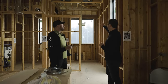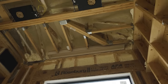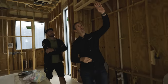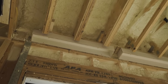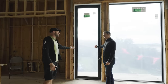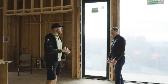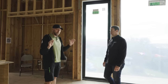Look how complicated this corner is behind us, Travis — we've got trusses, an angle, a bunch of angle brackets, and really amazing pre-planning there. On the other hand, we made a mistake. You noticed this right away — what's going on with that plywood on those trusses? As someone who has had to modify a truss in the past, that's the telltale plywood wrap. This is a door, not a window. So if you go around and make all your pockets off the window schedule, you miss the door. If you're going to cut a truss, you've got to talk to your engineer. The truss manufacturer has their own in-house engineering firm that deals with field repairs — get them to sign off and do it exactly the way they said. It's no problem.